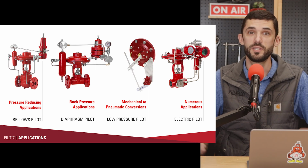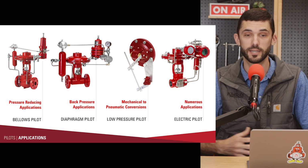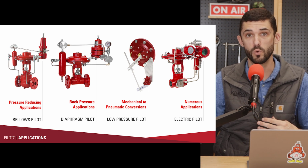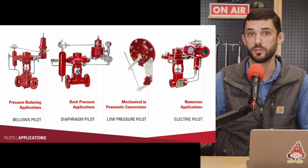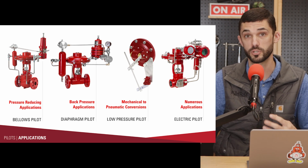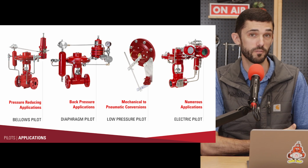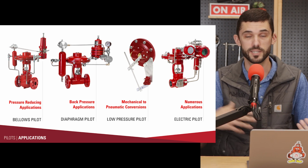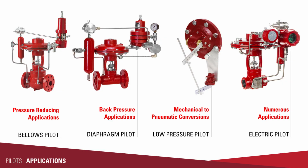So pilots and relays on their own don't do anything. They need to control something. They are communicating with other pieces of equipment, other control valves, and controlling certain processes. Just like a control valve on its own won't do anything, it needs a pilot to tell it what to do. And so all of these pilots that we'll look at are helping to control processes.